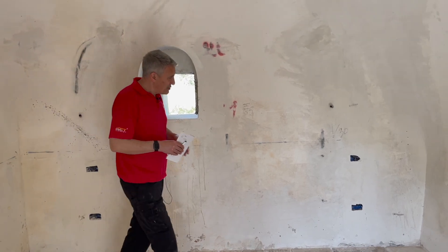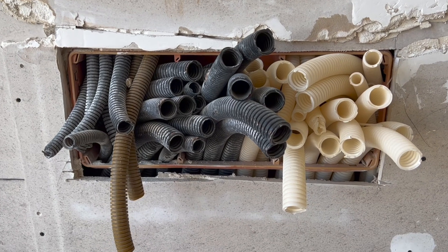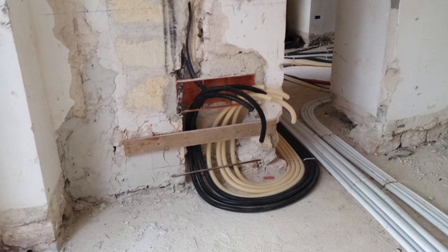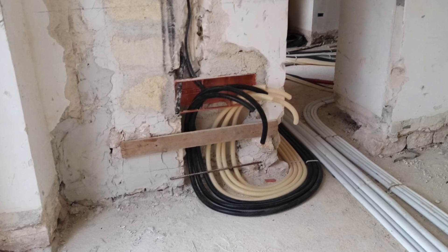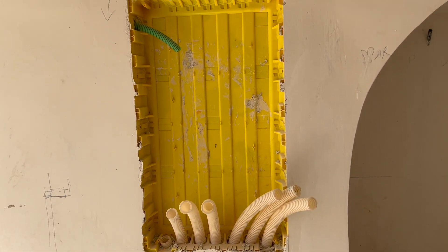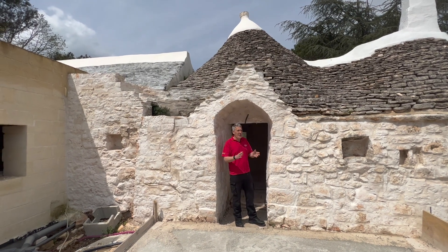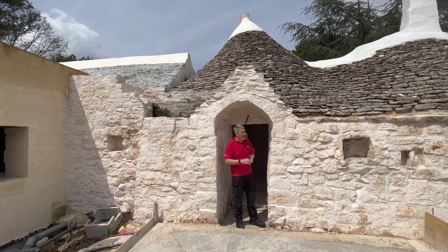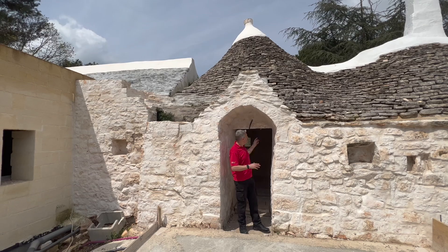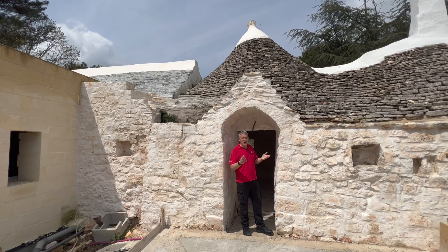We're not doing any rings here of course. When it comes to the under-floor system, this conduit is buried deep under the screed so it can take the quickest route possible — there are no boxes in between at this end and where it goes to at the distribution board, which is natural as you don't want tight bends and corners when pulling cables into flexible conduit. I've also just learned that Italian electricians won't waste time doing things you don't have to do: if a light fitting is going to be double insulated — you know that square symbol — they won't run a CPC or earth wire to the fitting itself, and why would you? It doesn't need one.